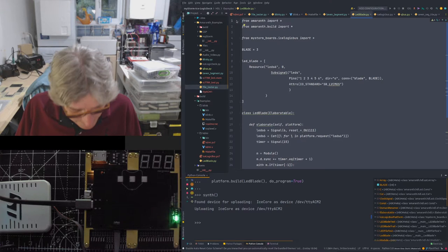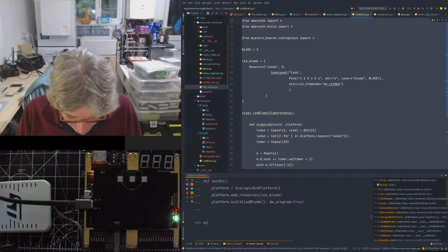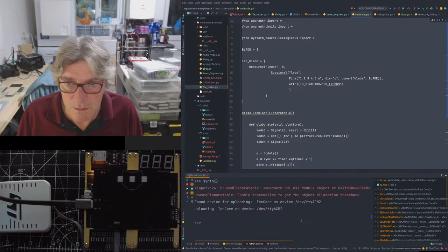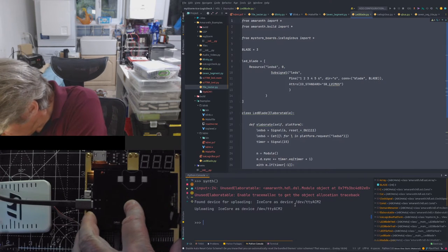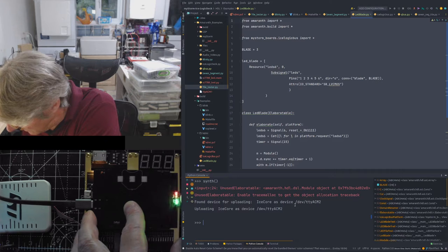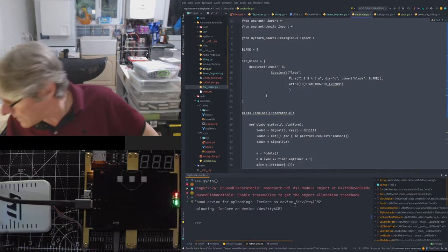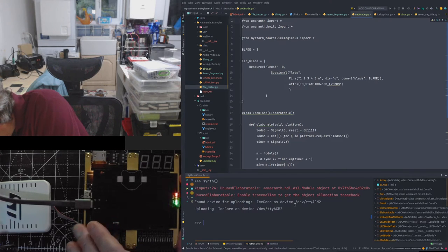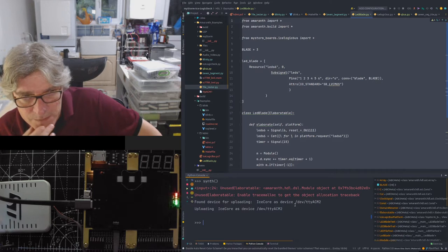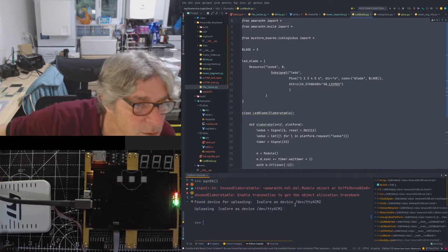Definitely going to have to do some mechanical work on these. Don't know what that was. So again, movement changes it. However, we are getting all of the LEDs working on this one. So maybe I need to check the socket on that one. Maybe it's got a dry joint on one of the conductors of this socket. The number three works okay, which is cool.